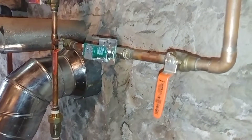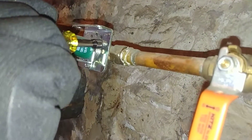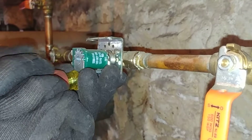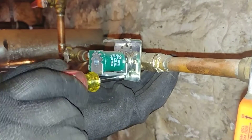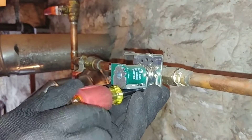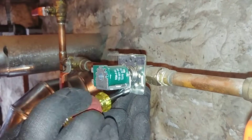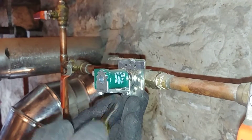Definitely we know the power is off. Now we want to get that bottom screw because that's attaching the solenoid. Underneath there is a little plastic wafer which likes to drop away and disappear — it's a number 10 nylon. You can actually get replacements at Home Depot sometimes.